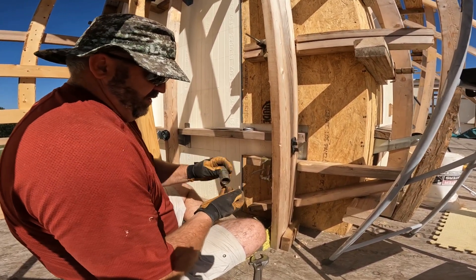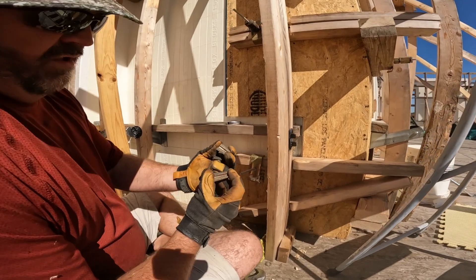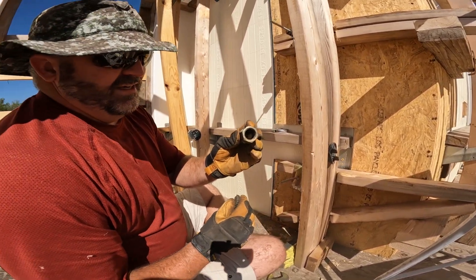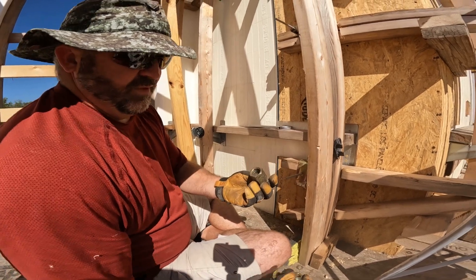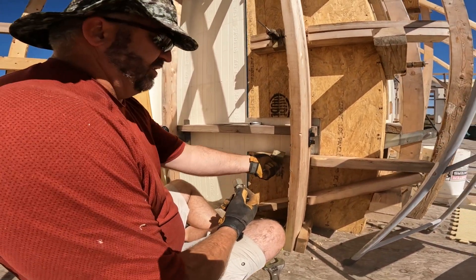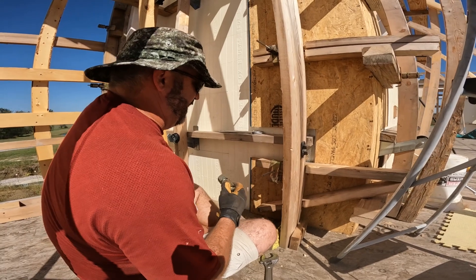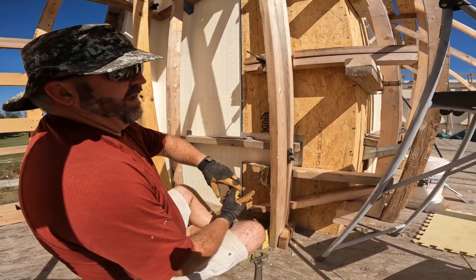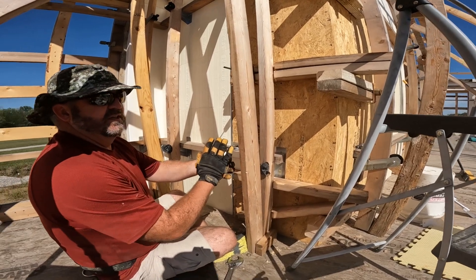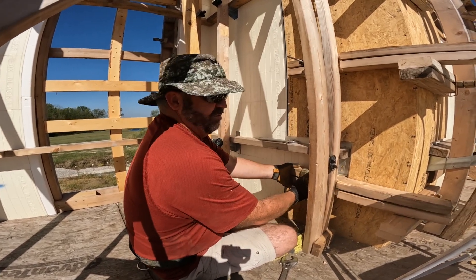So we're putting on pencil rod, which is the fiberglass rod right here, and they have these wedges that are ridged on the inside so they'll grip. They go down inside of these little clamps, and then this pushes on the top of those wedges and wedges in like that so that they clamp onto the pencil rod. And then this part screws out and acts like a jack and makes everything tight. This goes through the wall front and back, and the whole point of this is where we had our blowout last time, we'll have it braced and squeezed here, and that will keep that wall from being able to open up — so hopefully we don't have a blowout this time.